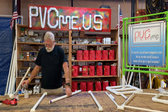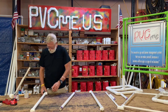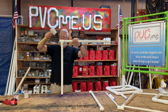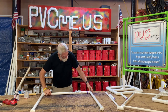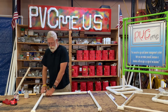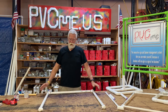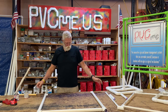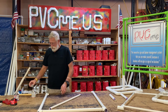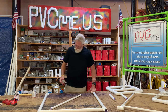When you're building these signs, after you get your uprights together, you want to put your bottom one inch pipe in first. Then lay the project flat again. Put the one inch pipe in the one inch fitting, push it on, double check. This side is set so I can stand it up, give it a whack, and it'll set this fitting. The project looks flat. I'm going to flip it over — all the fittings, all the glue is set by now. Remember, you only have seconds to make adjustments once you put these pieces together. So I'm going to glue up both of the half inch fittings.